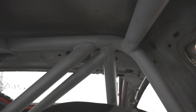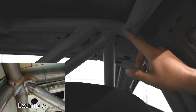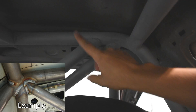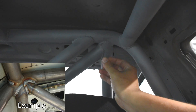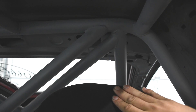An important design principle: try to have everything connect to one point — your side hoop, rear support diagonal, and main hoop diagonal all meeting at the same junction node. That makes an extremely strong design because everything ties together at one single point. In my build, I have things split up — the main hoop diagonal is pushed out for head clearance so I can push my seat back without hitting my helmet.